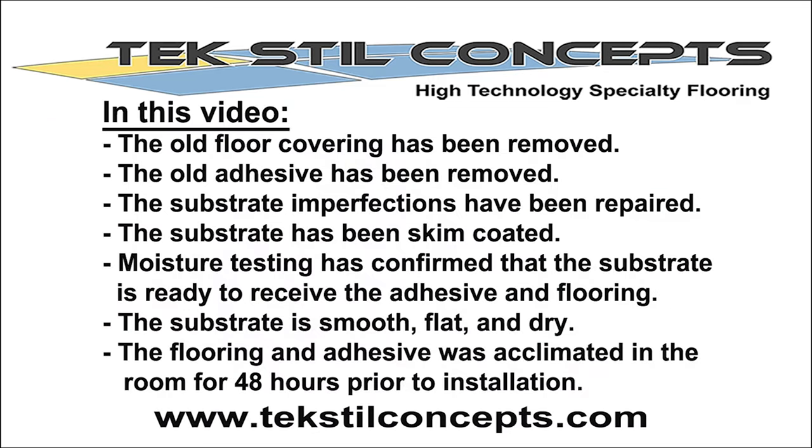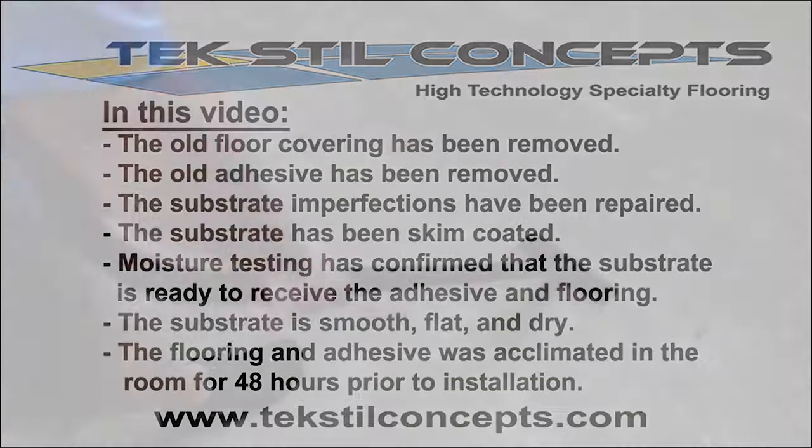In this video, the old floor covering has been removed. The old adhesive has been removed. Moisture testing has confirmed that the substrate is ready to receive the adhesive and flooring. The substrate imperfections have been repaired. The substrate has been skim coated. The substrate is smooth, flat, and dry. The flooring and adhesive were acclimated in the area for 48 hours prior to installation.